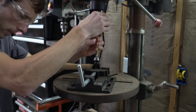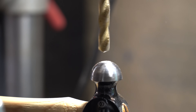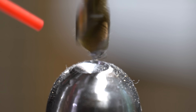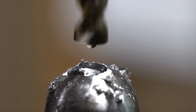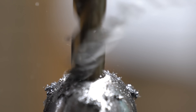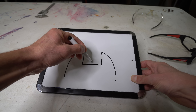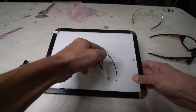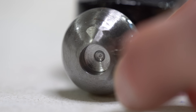Now we're going to use a 3/8 inch drill bit to drill the hole for the ball bearing. You'll need a quality drill bit designed to drill through hardened steel — I'll leave a link to the exact one I used down below. When drilling, go slow, use oil, and do not overheat the tip of the drill bit. My idea is to drill the hole slightly deeper than the diameter of the ball bearing, then use a punch to bend over the edges keeping the ball in place. I'll also use some JB Weld to fill in any gaps underneath.